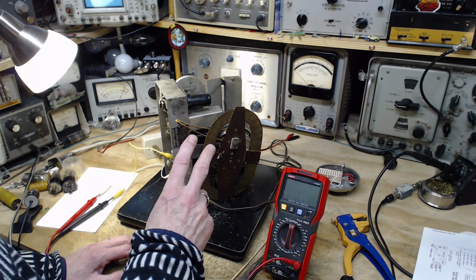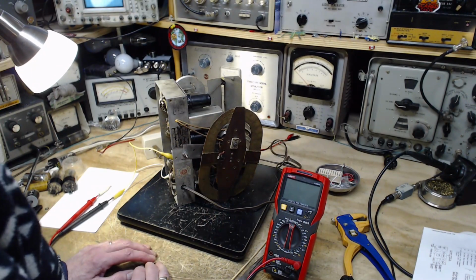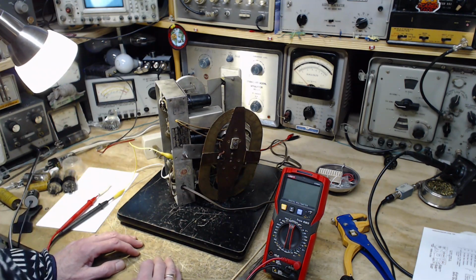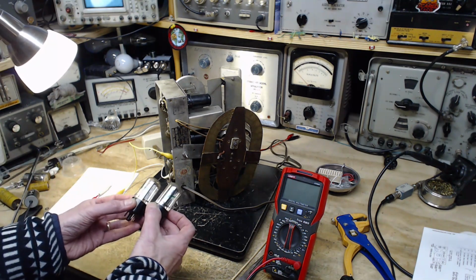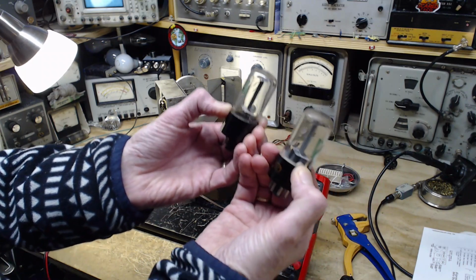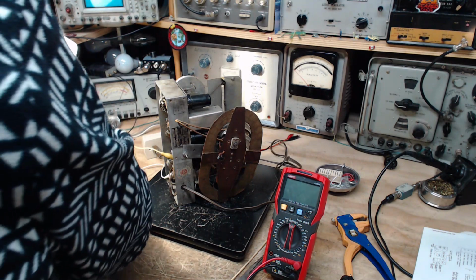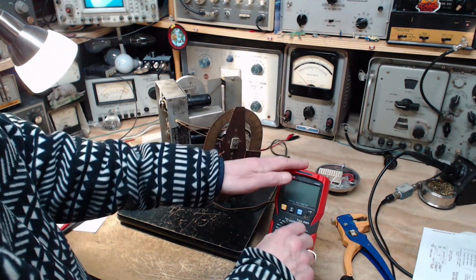Finally putting another tube in there, and I can't even remember what I did now, but somehow B+ went from 40 volts back to where it should be, 129 volts. And here's the weird part. I walked in here this morning and I looked down, and here are two of the three rectifier tubes. You see the green check mark on them? These are mine. Wait a minute. If these are mine, the one that's in the radio is the original one. The original one's in the radio. B+ is normal. I don't know what's been going on. What has been going on?